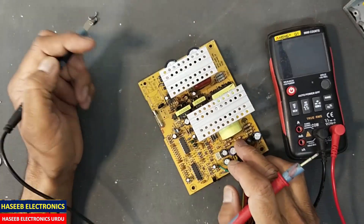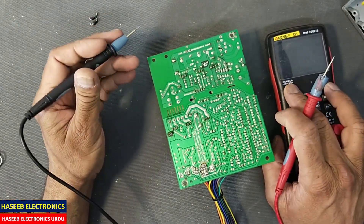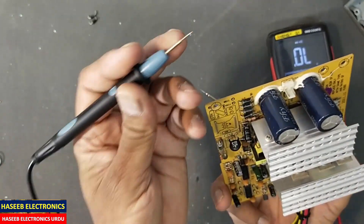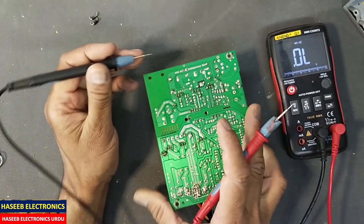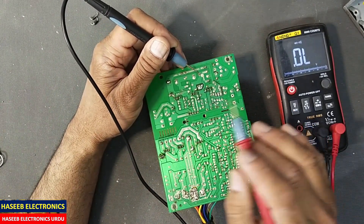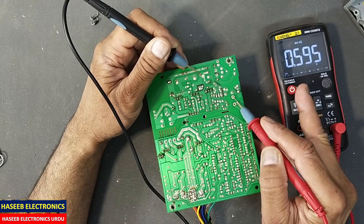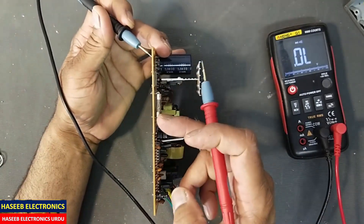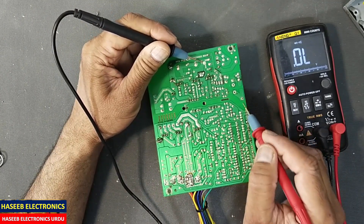Now after replacing these diodes we will verify the DC rail and the bridge rectifier circuit. Connect the black lead of the multimeter to the positive terminal of this capacitor — we have two capacitors here. Always ensure that these capacitors must be discharged. Connect one lead to the input terminal — it is 0.596, one diode drop voltage. The second input terminal is the second end of this fuse, because this time the fuse is open. That's good. Since the fuse is open we cannot fully check from there.